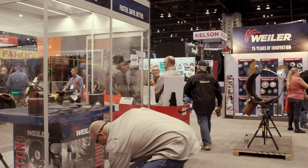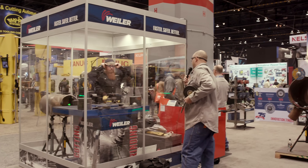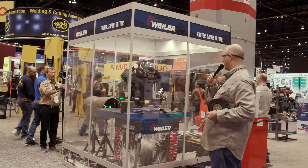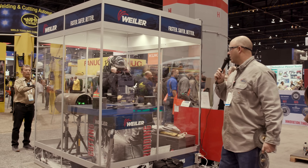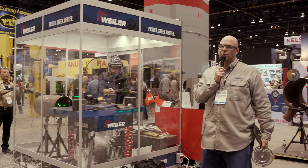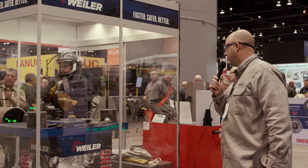So Jason's going to start with the stringer bead wheel. As he uses it, he'll clean the outside of the bevel as well — getting off some of the weld splatter. One of the things about a wire brush versus an abrasive wheel is it does not remove base material. So he's going to be able to clean off some of those BBs and clean that weld, but he's not going to change the configuration of the part. He's going to let the wire tips do the work — pressure is the enemy. You don't want to lean too hard on these wheels, as that's how you get long wire breakage and reduced wheel life.